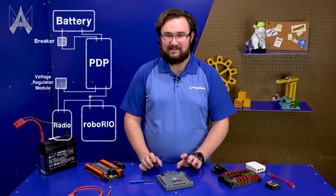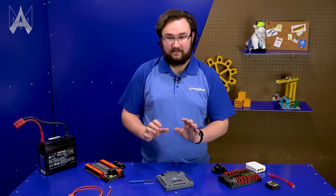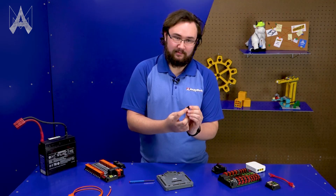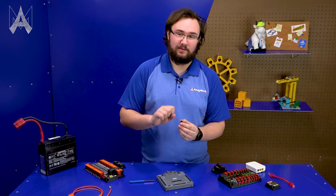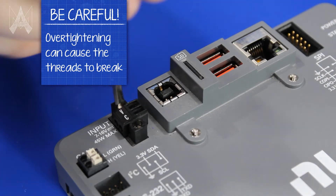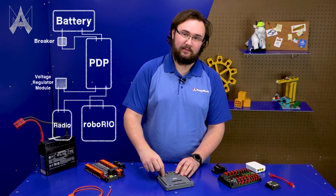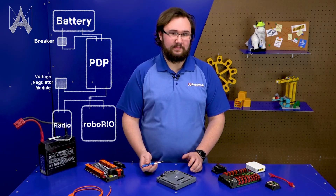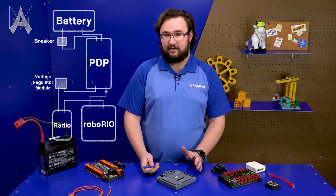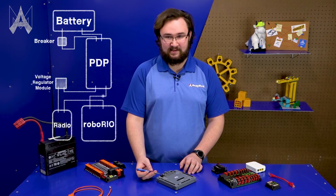The heart of the robot is the RoboRIO, and it has a single power connector right here. The best way to use this connector is to first remove it from the RoboRIO, insert the two wires up top, tighten through the screw terminals making sure the connection is really robust and tight, then reinsert it into the Rio and tighten the two flathead screws on either side of the connector. When a robot stops moving on the field, it's most commonly something along the main power path — generally either at the breaker or right at this connection. Make absolutely certain that this is tight, robust, and passes the tug test.